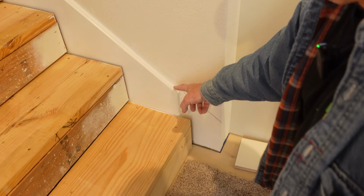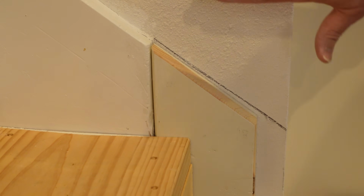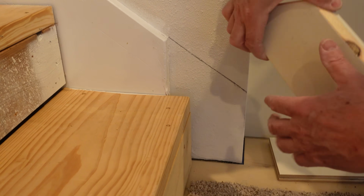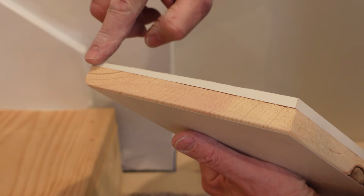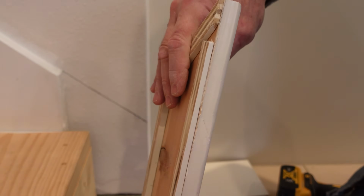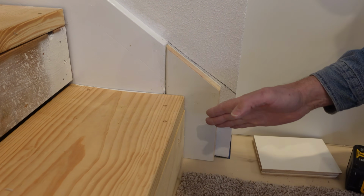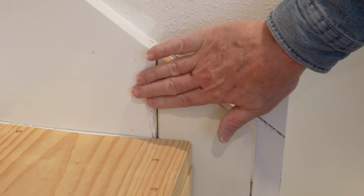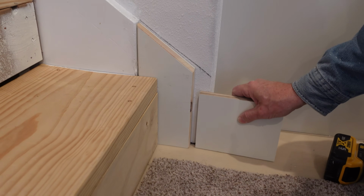This is kind of a thing that trim carpenters do that nobody ever gets to see. This was kind of challenging down here. So this is a skirt board, and I had to extend it down. So this is gonna fit in there like that. But this wall's not plumb to this, nothing's square, nothing's where it should be. So I got a straight shim here, a tapered shim there, and that's just a filler in the back. So when I put a nail there, it doesn't go in. I even rounded over these edges so it matches that one. So we'll Bondo that, and hopefully that'll just go away, and then our baseboard will die into that.